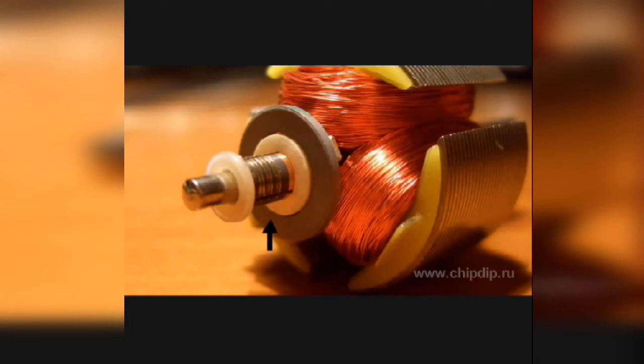The wound rotor motor windings are frequently combined into a single frame by the Schrage scheme. This motor is named after its inventor, and accordingly it is called the Schrage motor — also referred to as a super-synchronous motor, named according to its frequency and EMF function.